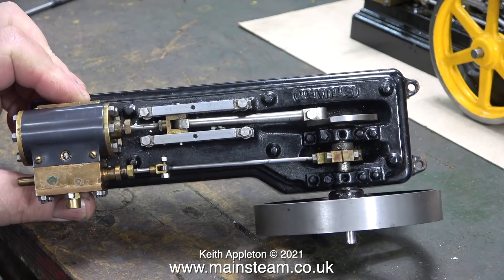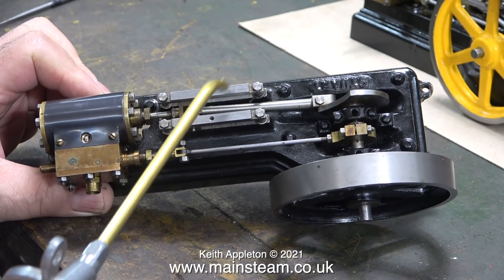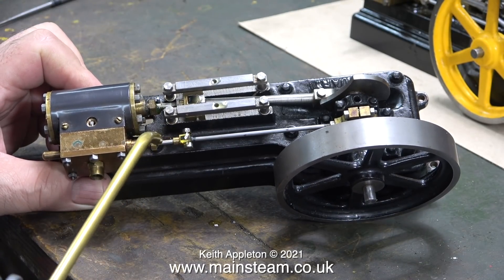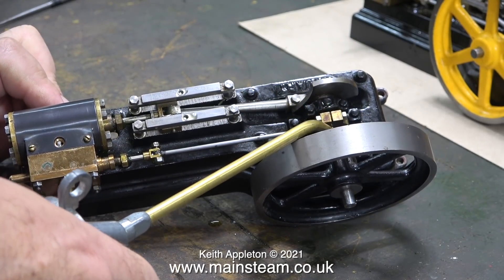Here it is — yet another S50 and it's quite well made. It's slightly better than the others, although I do notice that it has packing washers under the slide valve support guides. I think I'll make some more of these spacers that are actually the correct size.